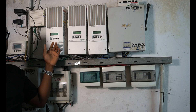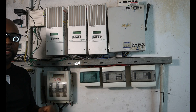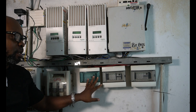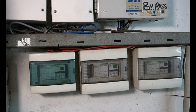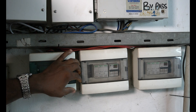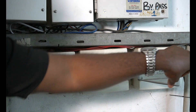These are MPPT charge controllers — they're Schneiders, very good units. We have enclosure boxes underneath the charge controllers to fuse them from both the DC and the AC sides. These enclosure boxes house the lightning arrestors and circuit breakers for the AC.